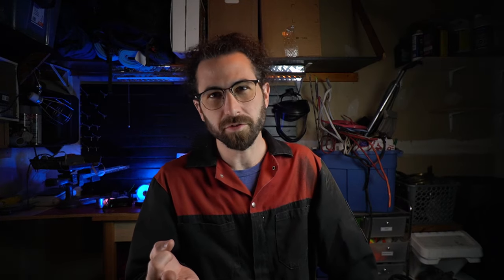Now, the other categories are cast iron. I say categories because there are several different types, and it depends on where you go. Some places will say breakable cast and non-breakable cast iron. The ones I have experience with are auto-cast and regular cast. Auto-cast is pretty much just brake drums and brake rotors. Regular cast can be cast iron pipes, antique bathtubs, some barbecue grills, a lot of outdoor decor, or the cast iron harp from the inside of a piano. These categories are actually worth a little more than prepared steel, but my yard gives me the same price for all of them. One thing I learned about cast iron pipe is they are often sealed together with melted, poured lead — but that's actually really easy to remove because it's generally old and rusty, and it's just cast iron and lead. They don't stick; you just beat it with a hammer and it comes off really easily.